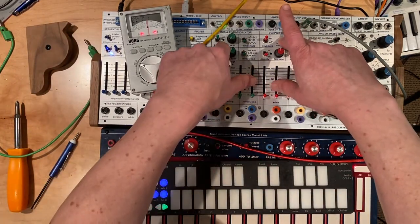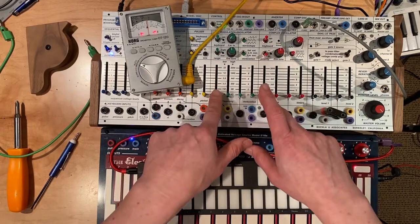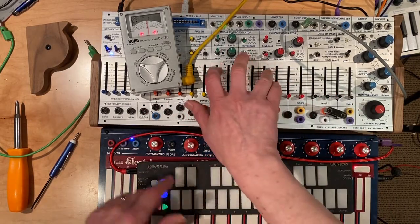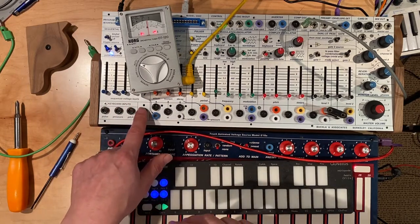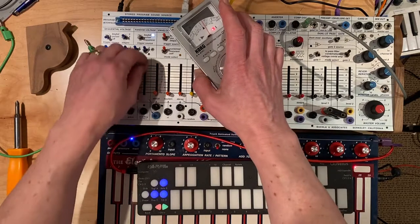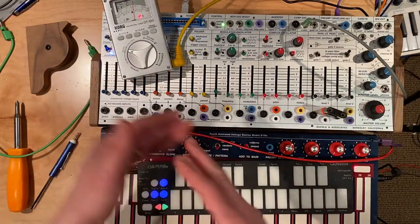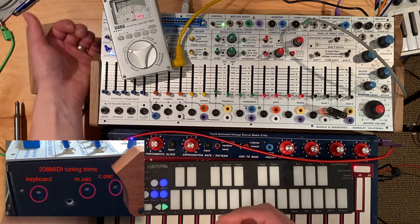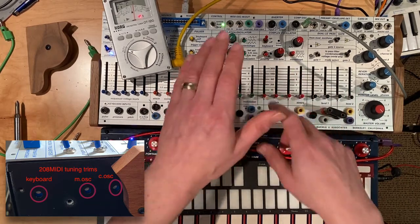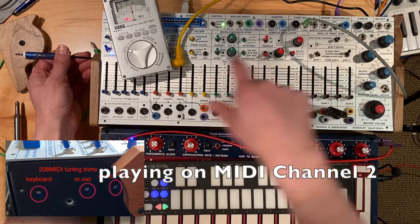Nonetheless, your focus is on these two trims. You can do the same thing with the trims here — on this input, there are trims associated with this fader. When it's all the way up, you can use the same routine and tune those two. There's also a trim for independent output, though I tend to find that trim is so touchy it's really better for tuning the sequencer to a low range like an octave or something. Beyond that, there are two more trim pots on the side for trimming independent use of the oscillators — so you can put one on channel two and another on channel three independently.